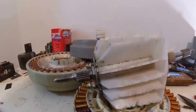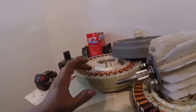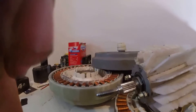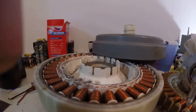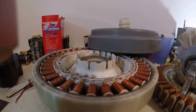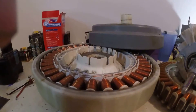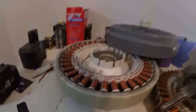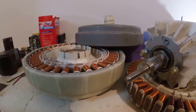Mount that in the bearing block with a pulley — it's a double brushless 42-pole motor which should be fairly smooth and quite nice to operate with a lot of startup torque from zero. Being 14 coils at a time per phase, with 28 coils working together starting you up, and then as soon as it moves a little bit another one pushing away — lots of startup torque. It'd just be like having two hub motors. I'll get a 1000-watt speed controller to be safe and go from there.